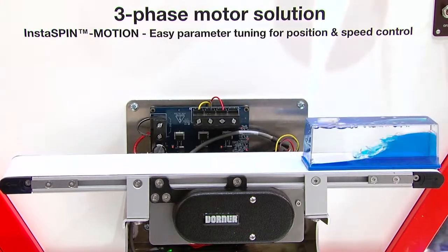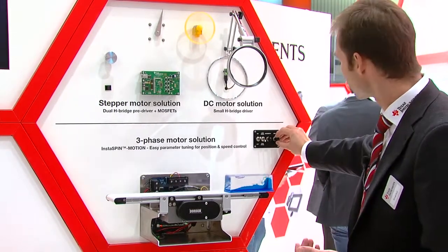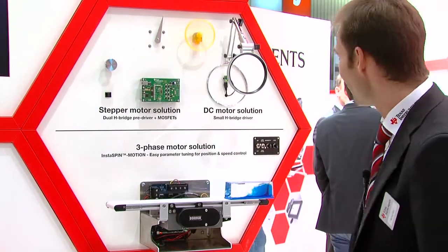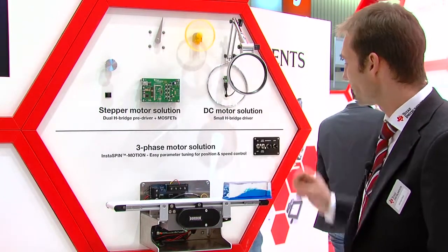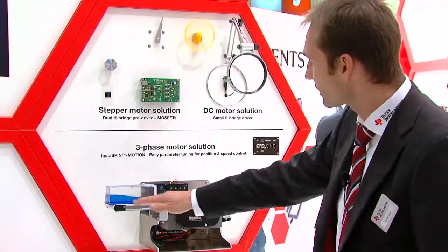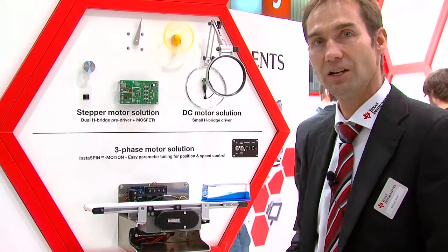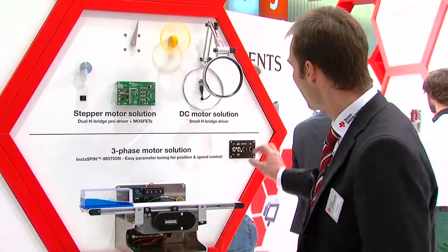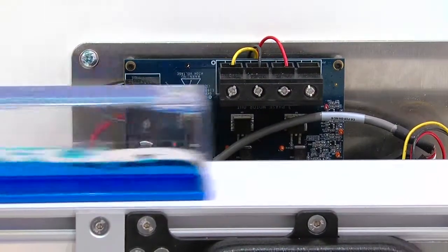until I'm really getting concerned about my little water toy here on my conveyor belt. So here with maximum jerk, you see that it's really not taking any caution with my toy here. Or I slow it down again and say, please be nice to it. And each time it tries to put the maximum speed on it, but it calculates the trajectory of the speed according to its movement plan. So the optimal performance of the system is always guaranteed, and it's all done with the single bandwidth tuning factor on this one.